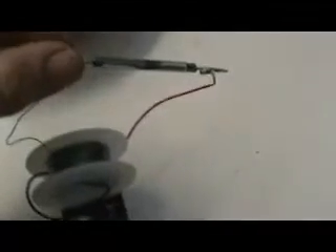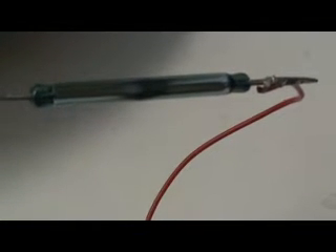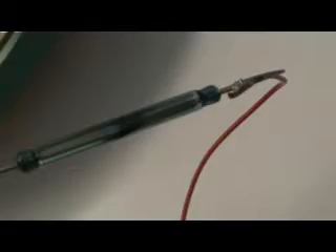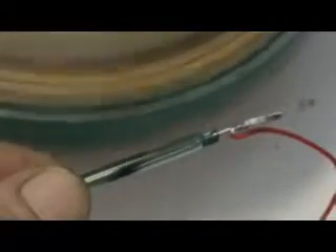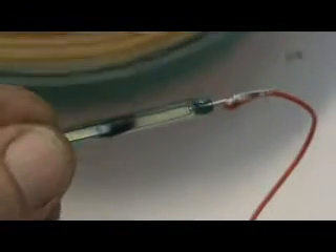As you can see, this is the entire circuit like I have previously explained. There's the reed switch. Unfortunately it is burnt out — it doesn't click, it doesn't tick. It's completely burnt, it is welded inside. And that shows, obviously, with all the black burn on the tube itself.